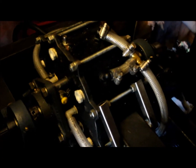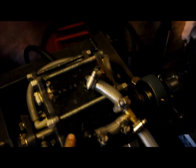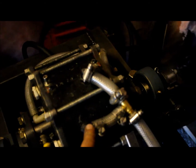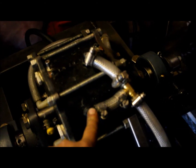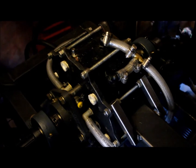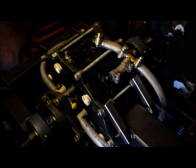I have 12 inlets in total; right now I'm using four of them. Water goes in there, water comes out. My rotor is Siamese, so I basically have two water brakes in one housing — two chambers. There's water coming out of this side and water coming out of this side, same thing on the bottom. So right now it's plumbed with four inlets and four outlets of half-inch ID hose. We'll see if that's enough.